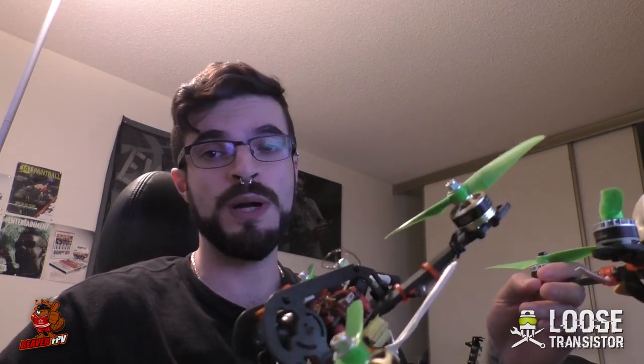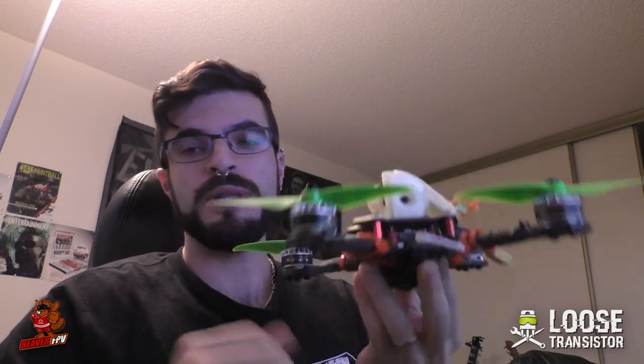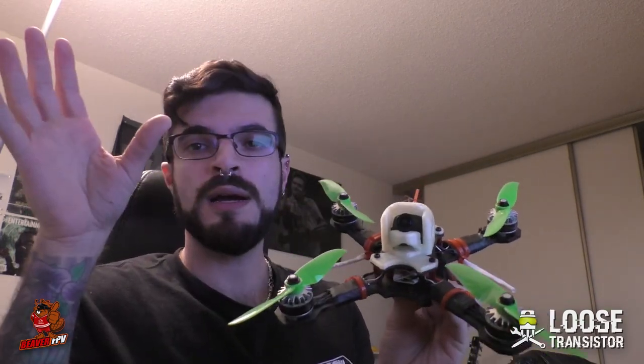My plan is to take two quads — not necessarily new builds, they've been around a while and are about the same age and wear. I want to see how Kalman filters do on a quad that's a little beat up, because that's what most of us are dealing with. I'm hoping Kalman is going to be kind of like the jump from bi-quad to PT1. One quad has an Omnibus F7, and I'll be flashing it with Betaflight 3.3 using RS2K's recommended settings. The other has a CL Racing F4 — my go-to FC — and I'll flash that with 3.3 as well. I'll also keep a stock Betaflight 3.2 with PT1 quad as a comparison.